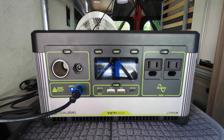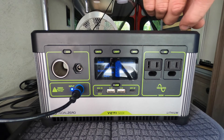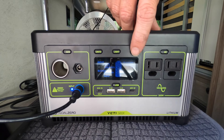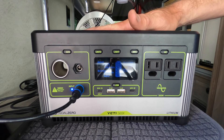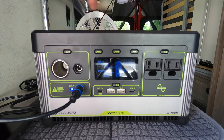It depends on the angle of the sun. It's about two o'clock here in the Charleston area in April, so peak has already gone by, but you can still see it's still pulling 30 watts. If you click on this info button, it'll actually show you we were at 95% fully charged. If we were not running anything, you'd be looking at 1.8 hours until the machine is completely charged again, running and drawing 30 watts from the solar panel.